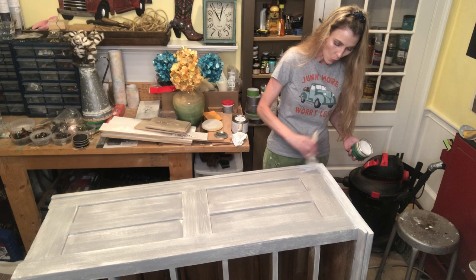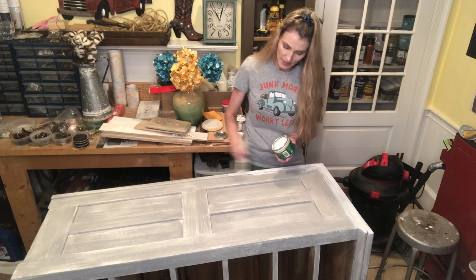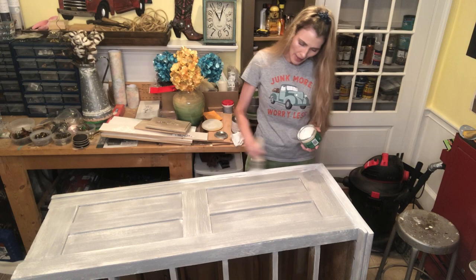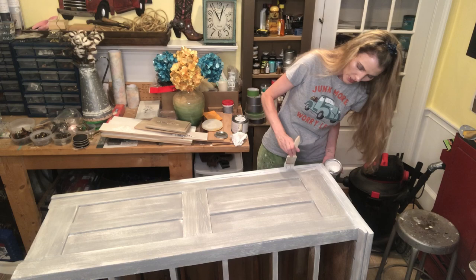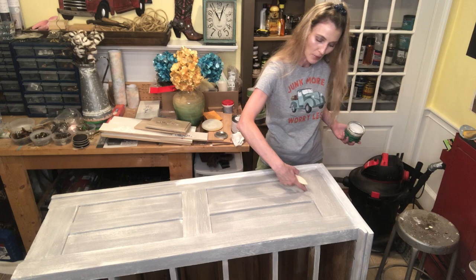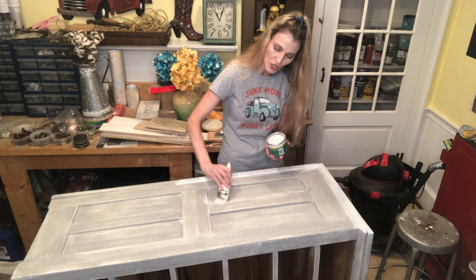I do this aggressive back-and-forth motion — I'm basically painting the dresser really really white. You can see how white it's getting, but that's okay because I'm going to be wiping the majority of this liming wax off. I really want to make sure it gets into the wood grain of this oak dresser. Liming wax stays wet for a while so you have a lot of open time to work with it. On the crevices of the side I really put it in there because I want to create a shadow effect.